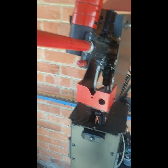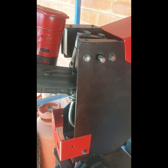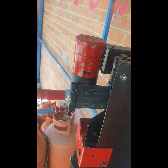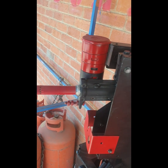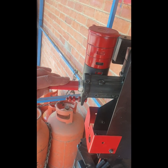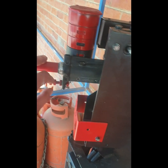And I know I'm going to get questions about this, so let me explain it. What's the purpose of this? Well, when you load your balls and your marker comes and sets, it's got to find its center of gravity. When we set it up, we didn't do it with pepper balls, otherwise we're going to get into a pickle if one of them bursts. Trust me, they are not nice. But because the weights differ, if the marker is a bit out, the servo's got to overcompensate every time, and that puts unnecessary strain.